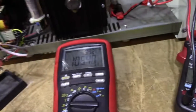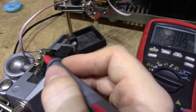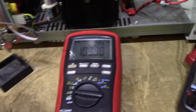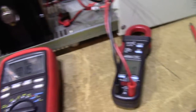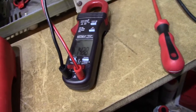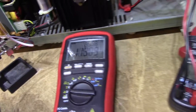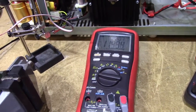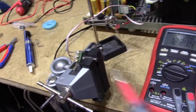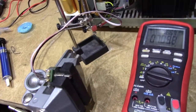A bit of noise, and 104V. Let's probe the other end as well — 102V — and that changes the output voltage a bit. That's reasonable confirmation that this potentiometer is on the secondary side, thankfully, which makes this a little easier to work with.